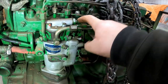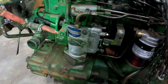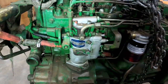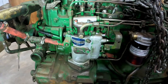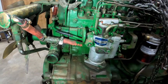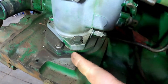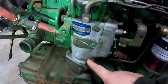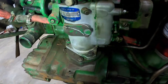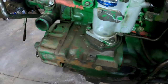Disconnect your injector lines and your return line. Most engines you have to line up to time them, and it wouldn't be an entirely bad idea to roll the flywheel around — there's an indicator under this window. When you put it back together, normally this window's sealed with a lead seal. The biggest thing you need to watch for is there's a hash mark right here at the base of the pump — this one lined up with that one. Once you have all your fuel lines disconnected and removed, take the three bolts out. They should be studs — this one's a bolt for some reason — should be studs with nuts on top, three of them going back here, and then just lift it on out.